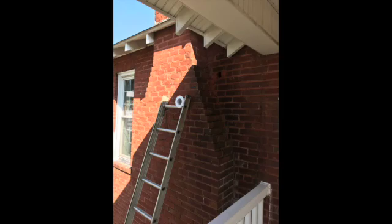So you have to do it on some big extension ladder of some sort, which is always unstable to try, and you have to use 2 hands to do this, and you're supposed to have your feet and at least one hand holding on the ladder. So what we did to avoid that problem is to make the connection inside the room, nice and straight like this, made it all, and then fed it as a unit, the line set along with the head. As we mounted the head, we pushed the line set through the wall.